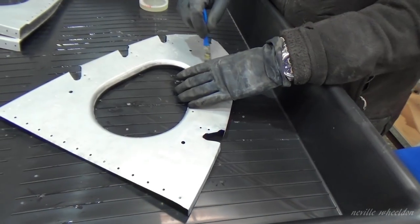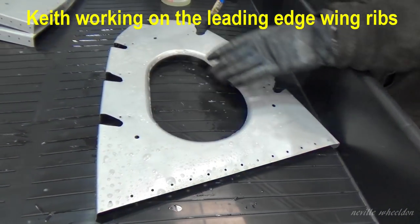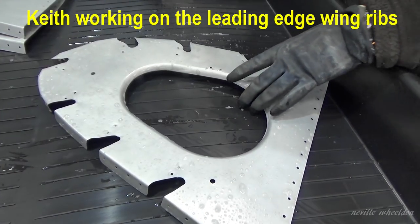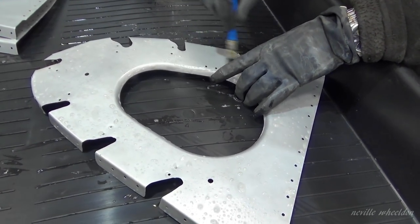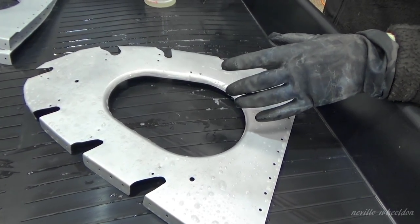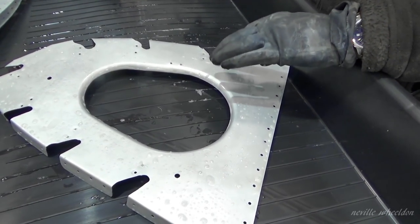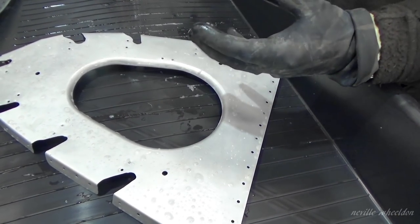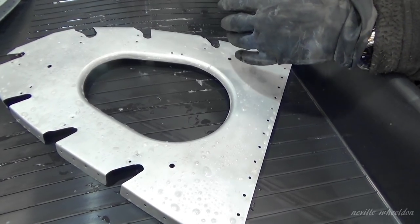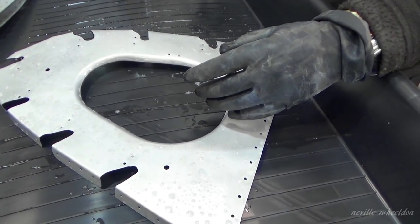So what are you treating it with? Deoxidine 624, which is phosphoric acid. And that stops it from corroding up again, does it? Well, no, all it does is deoxidise the surface of the material. You can't grind all of the corrosion out, some of it you can't even see, because it gets in between the granular structure of the material. So this stuff soaks into the corrosion that's left there, and encapsulates it. And it retards it. So rather than corroding away in 6 months, it'll probably corrode away in 10 years.